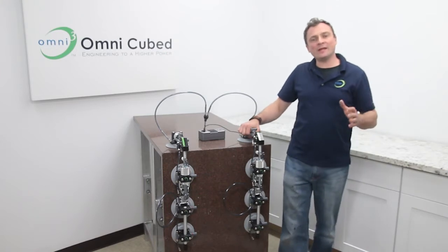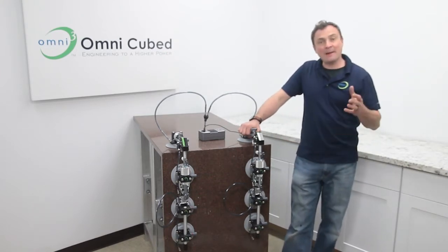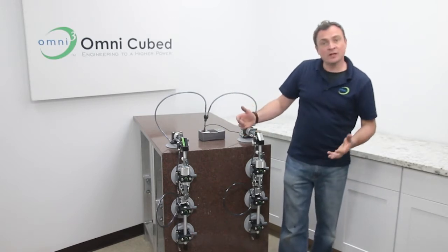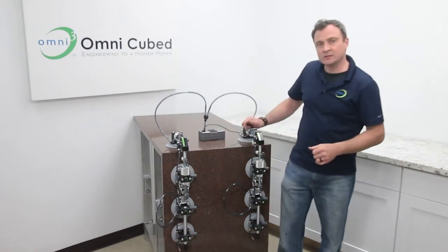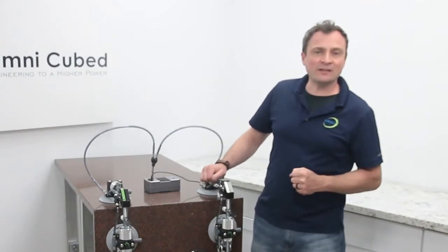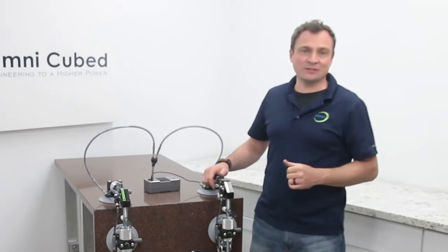Today I'm going to be demoing how to use the 90-degree stealth seamer on a mitered waterfall. Now, I'm presuming that you already know how to set seams and even waterfalls, so I'll just be covering the techniques that you would use with the 90s to easily set outside drop edge seams. In a previous Pro Overview, we have explained the features and general functions of the 90-degree stealths, so I'm not going to be repeating all that, but go ahead and check out that video if you haven't seen it already.